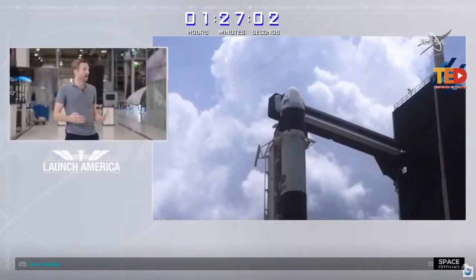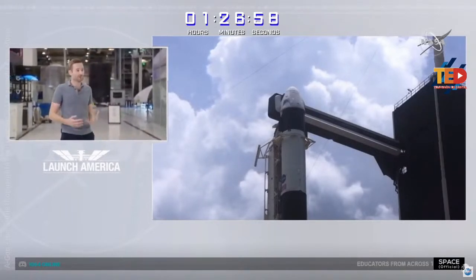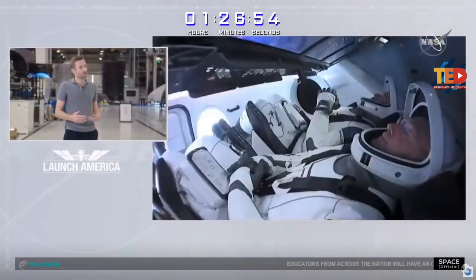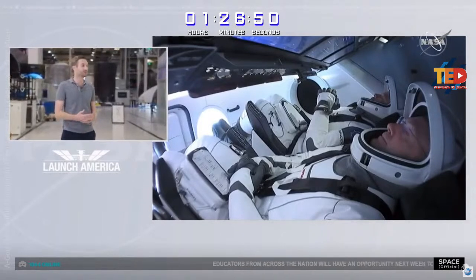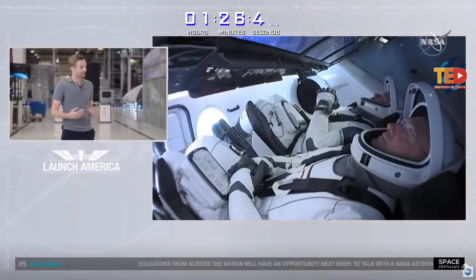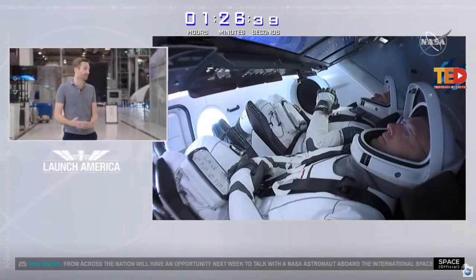Yeah, so figuring out propulsive landing is really the key part of it, but what people may not realize is that every time we bring Falcon back, we do something called an entry burn. So just before we hit the atmosphere, we light the engines to slow the rocket down. That happens high up where the air is very thin, and it just so happens that the conditions there are very similar to what a Mars landing burn would look like.